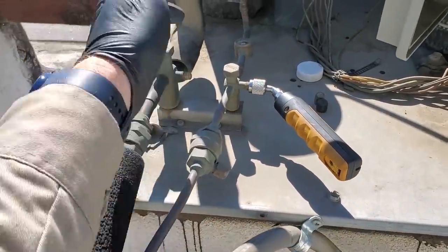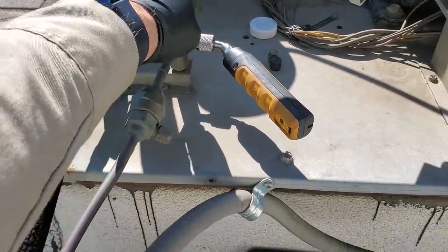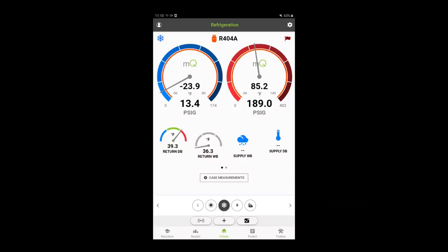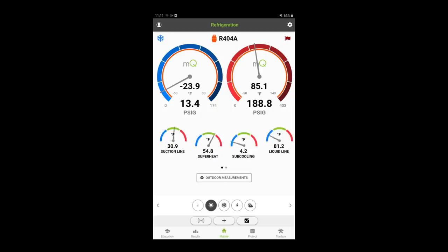We are hooked up. I've got my suction port hooked up downstairs and my suction probe to get evaporator superheat. This one's hooked up on the liquid line. Our system is pumped down — it's not running at the moment. You can see our return dry bulb temperature is 39 degrees, and everything else really doesn't matter until the system turns on, so we need to see at what temperature the system turns back on.